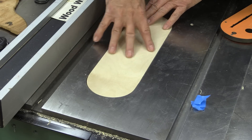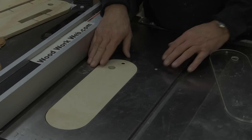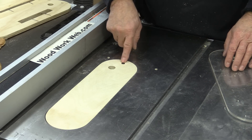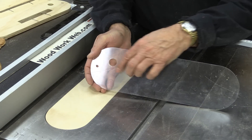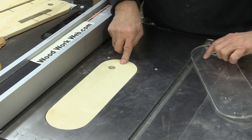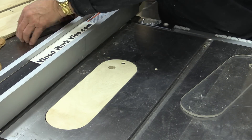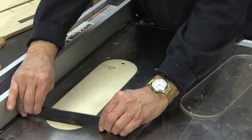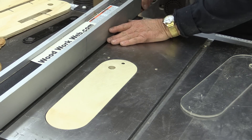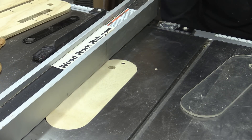That is a bare insert, and next I'm going to show you how to pull a blade up through that. The plate's all done — I just took a moment to put the screw hole in the end there. You can see in my template where I have a hole right there. I just countersunk it and made sure that everything is flat. When I run something over it, this plate is actually very solid in there, and I can see that it's flat and even with the table. Now I've got a blade installed there, so all I'm going to do is just bring it over the edge.